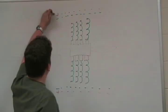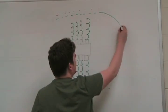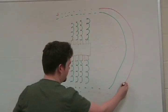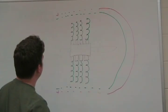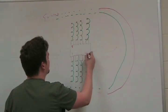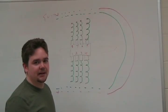Now, if you can't see above, I've got another red power line and a green ground line. We're going to assume we've taken a wire from up here and connected the ground to the ground line, and another one from the positive power line to the bottom one — just because it's easier that way. So if we've got five volts on the power line and we want five volts at pin eight — this is pin one, pin four, pin five — I'm going to fill them all in: two, three, five, six, seven, eight. We'll talk more about those types of pinouts later.